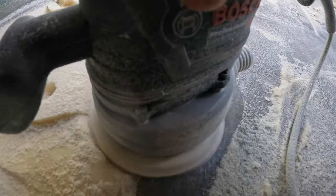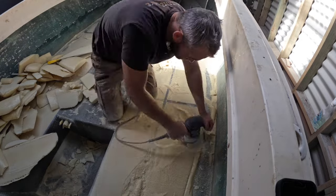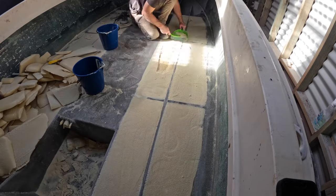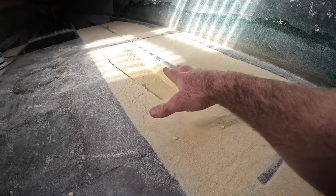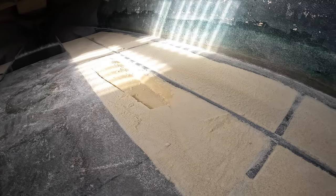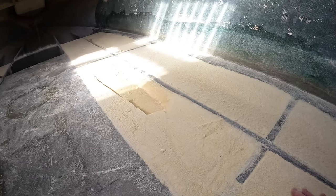What I'm going to do is cut down this side now, try and stay as high as I can, sand it down to where we need it to be, and then we'll come back, clean everything up, and foam fill all the little voids again — should only be one more step away from sanding this down and prepping it for the floor to go down. This side came out a lot better because I stayed high with my cuts.